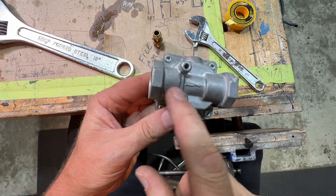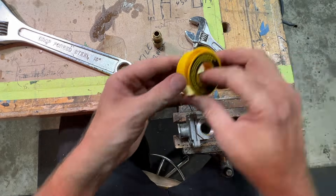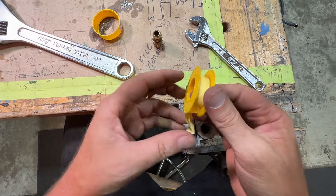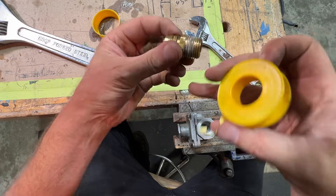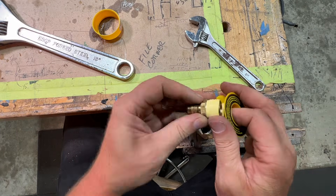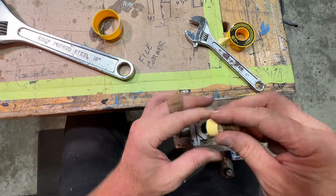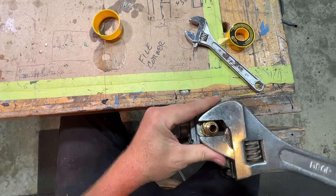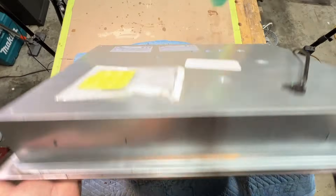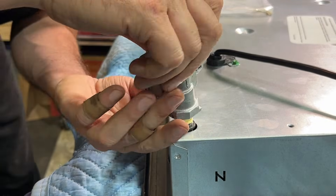On these regulators there is an arrow — we want the incoming gas going into that side. I'm clamping this in the vise. I'm using yellow gas line tape, and you always want to wrap clockwise so when you thread it in you're reinforcing it as it tightens. This is an aluminum body, so don't put so much pressure that you crack anything. On the bottom side is where the pipe comes out for the gas line, and now we spin the regulator on.